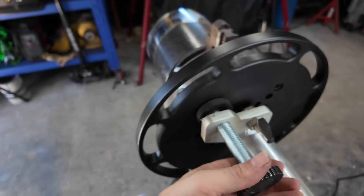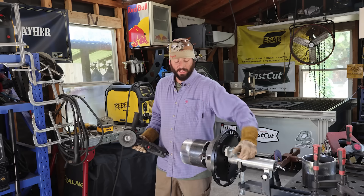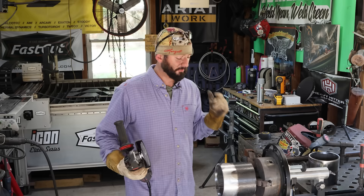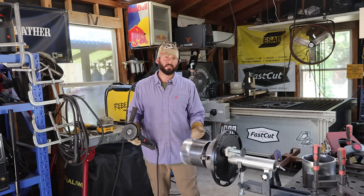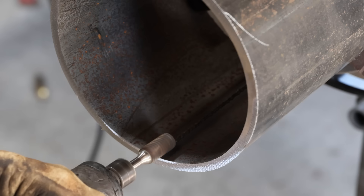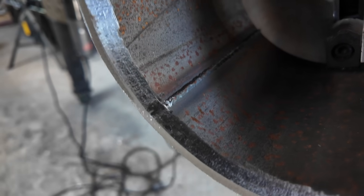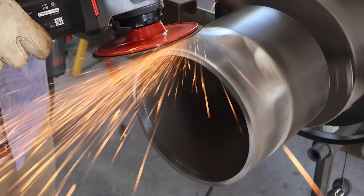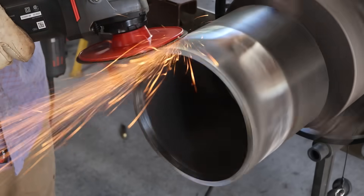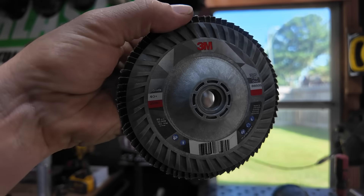This slow roll wheel from Tri-Arc Weld Supply has a couple of locking mechanisms so we can hold it in position, or just let it free-spin which is probably the fastest way. But the realest way is putting it in a fixed position and working around it. Before I touch the bevel I like to do a little additional prep on the inside and outside of the pipe — cleaning out any mill scale and backing off that seam a little bit so the weld has something to sit on.